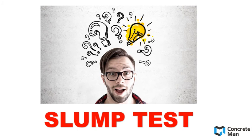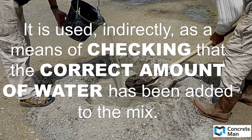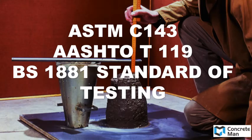Today we're going to talk about the slump test. So what is the slump test? The slump test is used to evaluate the consistency of fresh concrete. It is normally used indirectly as a means of checking the correct amount of water that has been added to the concrete mix.